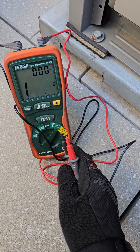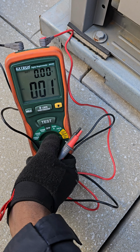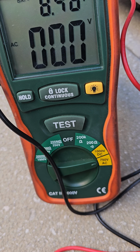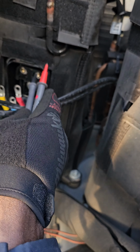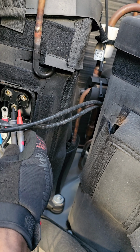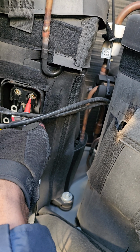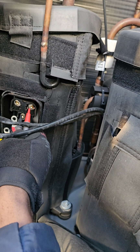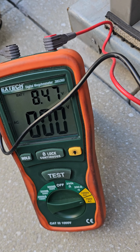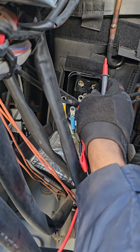Now this meter here is versatile enough. It checks even voltage as well. So I'll make sure that there's no voltage left on my terminal, because I was doing meg testing and this thing is charged up right now. And then there's no feedback into my meter. I don't want that. So the voltage is going to drain anything that's in there. We'll drain that out.